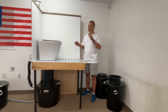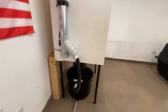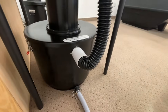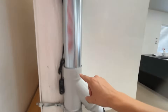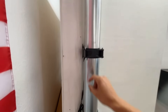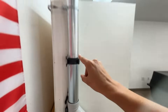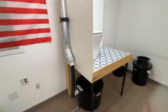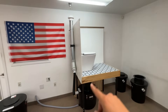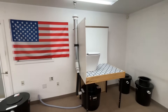Now let's look at some of the most important design features of this toilet. Key to the system is the ventilation. This is essential in keeping the toilet odor free at all times. There is a constant airflow from the composting unit drawn by an electric duct fan that operates at 12 volts, with a plug that connects to your mains or solar system. The fan ensures constant negative pressure from the composting unit, keeping the toilet odor free — in fact more odor free than a regular flush toilet, as there is simply no odor coming out.